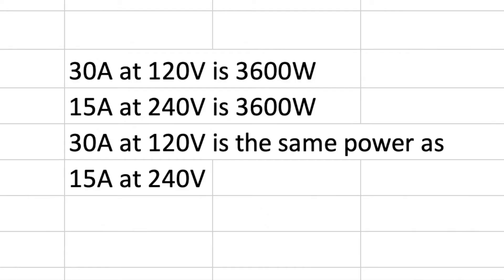To get the same amount of power output, a higher voltage requires less amperage. For example, if we needed to power something that required only 120 volts, it might need 30 or 40 amps, but at 240 volts it would only need 15 or 20 amps for the same load, because of the way the power formula relates voltage and current proportionally. That's the main reason the two different voltages are very helpful — 120 volts is safer, and 240 volts is more capable for our high-power loads.